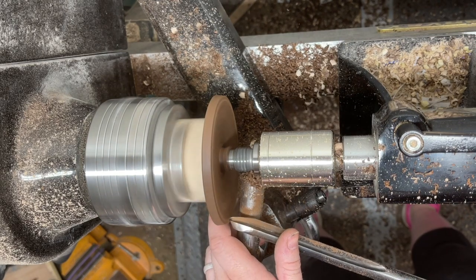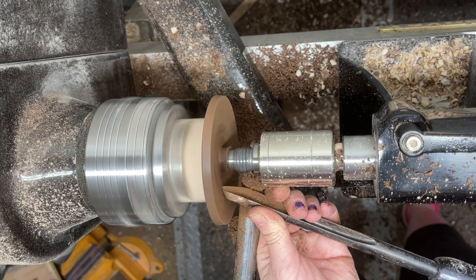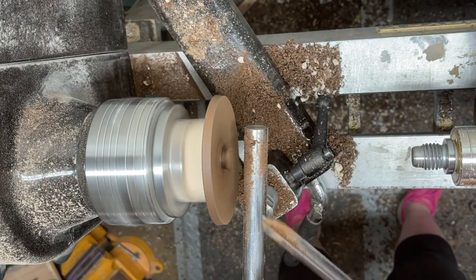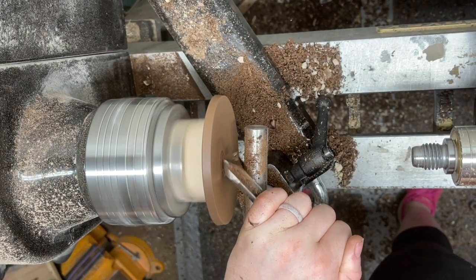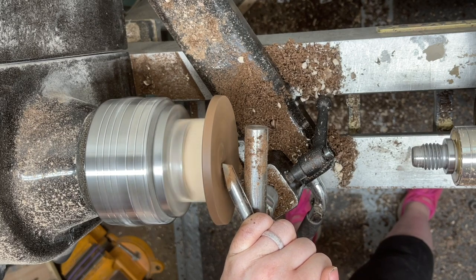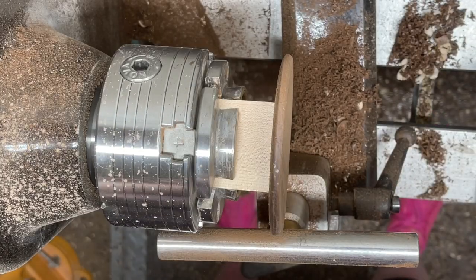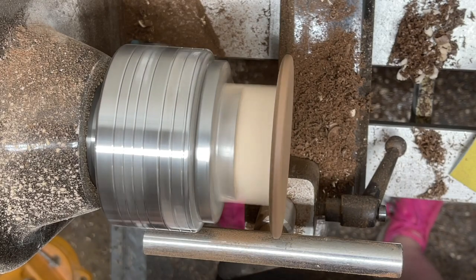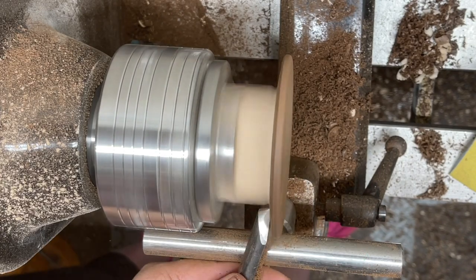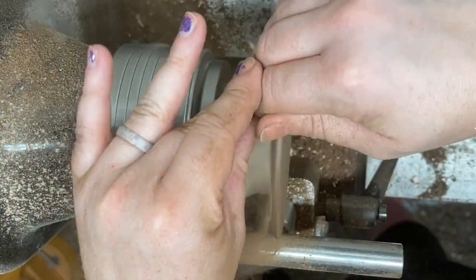I'm also taking a little bit off the back so that I can rest my finger on it. There's a lot of chatter, and that's just because those thin areas at the edges of this tail shape are slightly unsupported, giving me a little bit of flex when I turn it. This is Peruvian walnut, and it's very stringy when you try to turn it — it doesn't come off in chips or ribbons, it comes off in long thin fibers, and it ends up being kind of difficult to turn, but it looks nice when done. Round over that corner so you don't have a sharp edge, and then shape the back a little bit before parting it off. This will make it easier to refine that back edge without having to do too much work afterwards when it's put on a sticky block with tape.